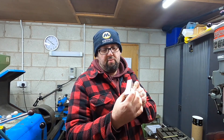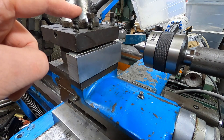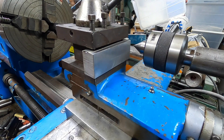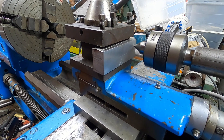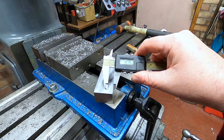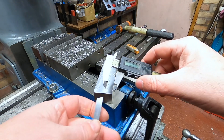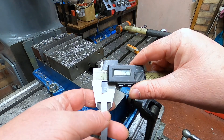The block is 35mm wide, 24mm deep, and 100mm long. I'm going to put a slot in the side to accept this piece of HSS. To get it as close as I can without needing to set the lathe up, I'm going to put a mark on using the lathe — with the block in the tool post, I'll use the end of my revolving centre just to put a line on so I know where the height of the tool really needs to be. The mark is 10mm from the top, so we need a slot from that 10mm down towards the bottom that's 7.95mm.